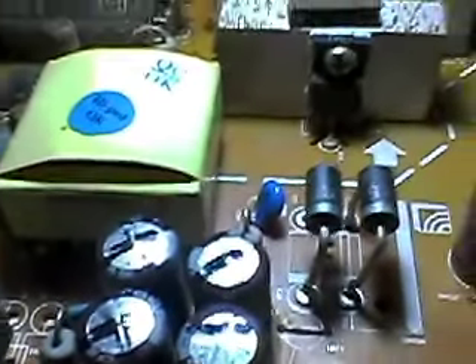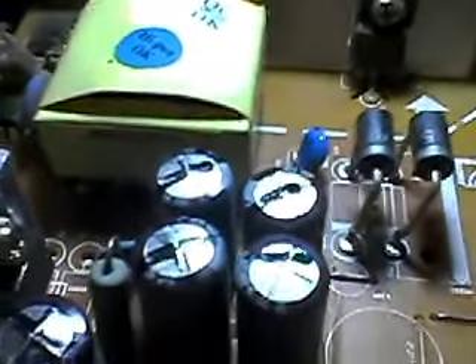They all appear to be venting because they're all bulging. There we go — those are the ones that need replacing. I've already ordered some replacements so we should have enough capacitors. It doesn't look like there's any other kind of damage — no burns or anything — just those capacitors. That's what I predicted, because it's the most common problem, and I did hear them venting. They're definitely bulging.